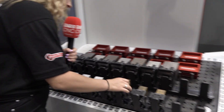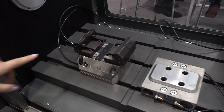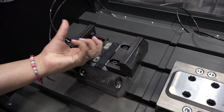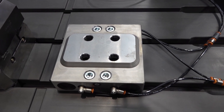If we go and have a look inside, you can see the pneumatic vice where you put your raw material, which will then be made into a part and taken out. And here is your zero point — so if you've got a specialist part that needs to be exactly in place time and time again, this is the automation system for you.